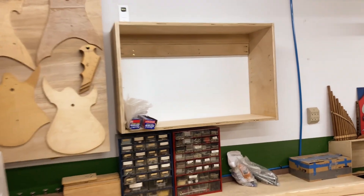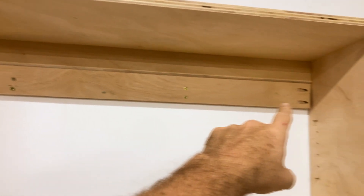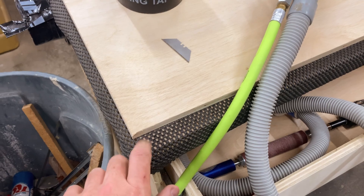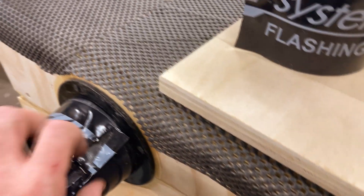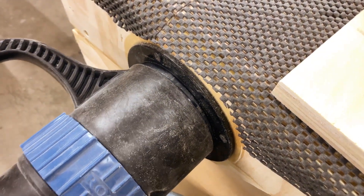I got the carcass of this shelf up — it's going to be a cabinet. I'm going to have two shelves, one here and one here. I attach it with French cleats just because it's way easier and even more sturdy, plus I don't have to put a back on it. I integrated the French cleat into the cabinet frame itself so there's no gap between the wall and the cabinet — it's flush. Now I'm just sanding the shelf, knocking off some rough edges. The dust collection attachment for my downdraft table wasn't perfect, so I added some flashing tape to it to make a tighter fit — that should work perfectly.